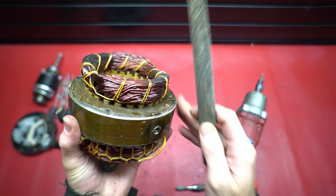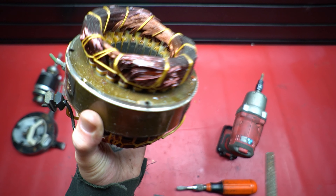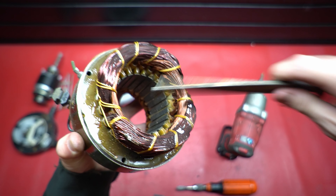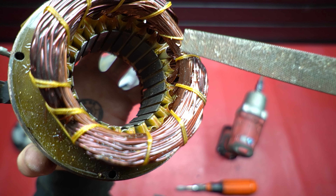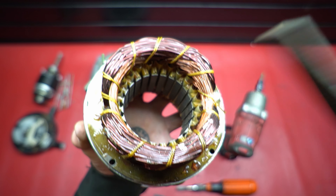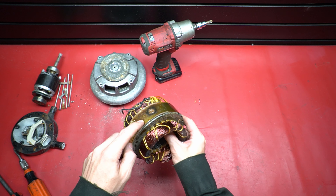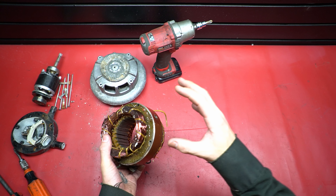That's a real nice looking lump, but remember we mentioned aluminum — we want to be sure. And unfortunately this one is aluminum windings. Sometimes they alternate. See there? The small one is showing a copper color and the bigger, thicker ones are all aluminum. So even in the 70s they were starting to get cheap. For this one we're just going to stop there because otherwise we would get 50 bucks a ton for the steel, but in this form we'll get 8 to 15 cents a pound for the motor.